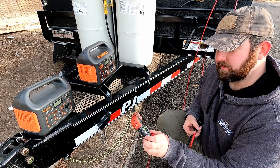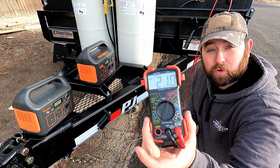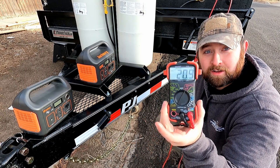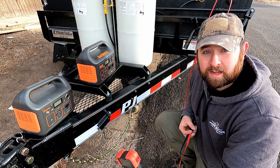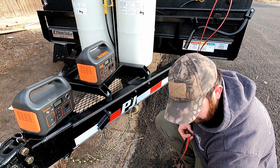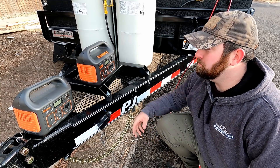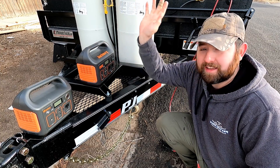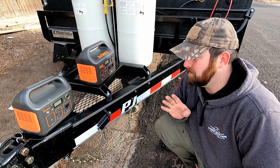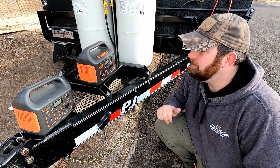What I want to show here is that I'm actually still only getting about 21 volts, which is exactly what I should be getting — the voltage has not spiked across all four panels. This shows me I have not wired anything incorrectly and it's not in series, so I haven't bumped up the voltage. These Jackerys can only support charging in parallel, not series. As long as the voltage remains below about 23 volts, this thing will be perfect.